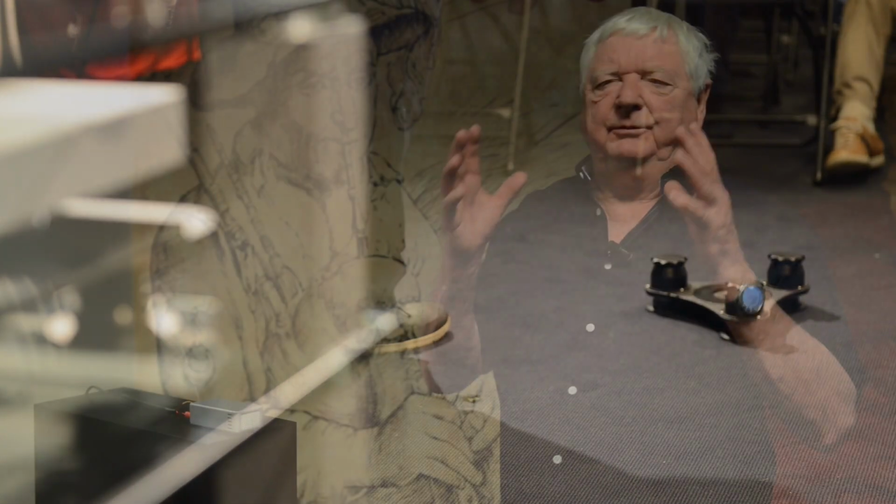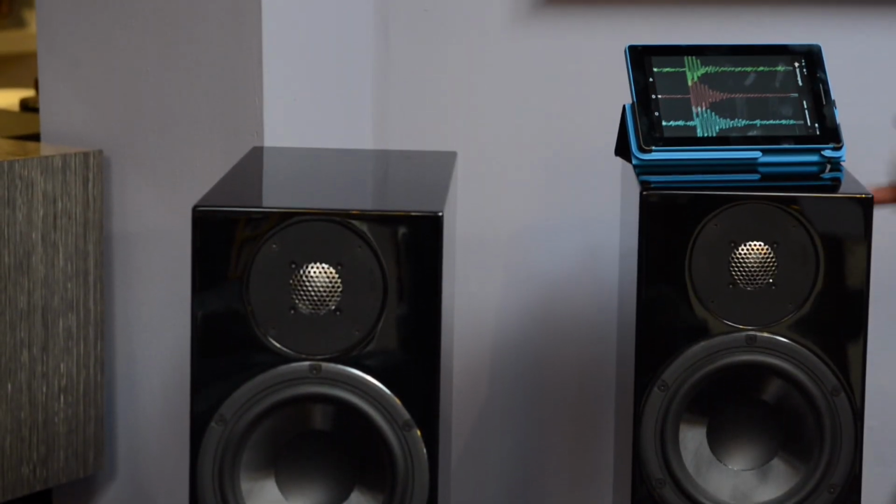Well, at high frequencies, the cabinet moves as one block. But when you've got a speaker on the floor, you've got like a ruler in a vise, and if you get a sound, you've got a resonance between the cabinet and the floor, and that smears the bass notes and also transmits the sound into the floor. But when you've got it free in space, if the cabinet moves, it just moves like this. There's no ongoing ringing.